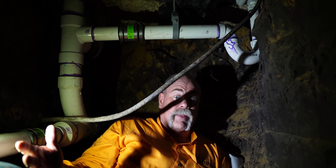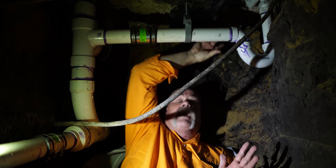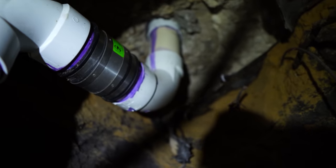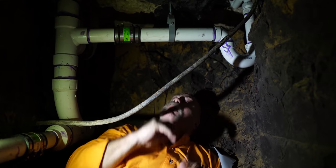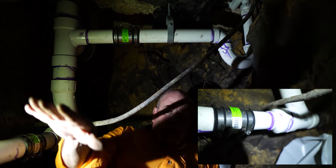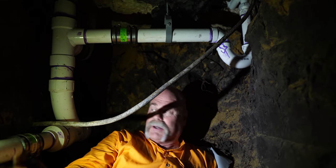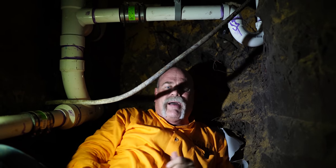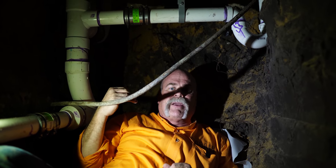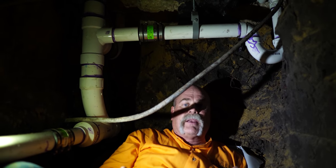We still made repairs here too — a two-inch line going over here coming up catching the bathtub, coming off this toilet, rebuilt with shear bands again so nothing offsets. This line from here back was broken in two places, completely fell, and was stressed. We dug out the side of the ditch a bit. When we tied into the main, we built everything all the way up to the bottom of the slab. We filled it up for the plumbing inspection, tested everything, the inspector came out and it passed.